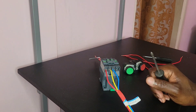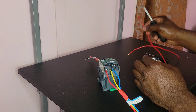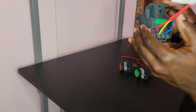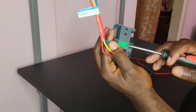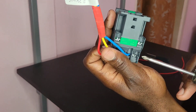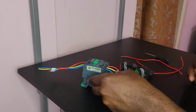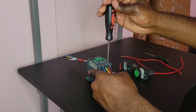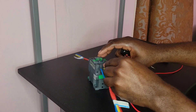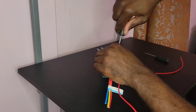Now it is time to connect our stop and start button. I also have to ensure I check the coil to see the type of coil it is. I'm going to check to see the voltage — not sure if you can see it on camera, but it is 220 volts. One of these lines is 220 volts, so you have to check and ensure that that is correct for you. So from my red phase, I'm going to connect my wire here — it can be any one of these phases.